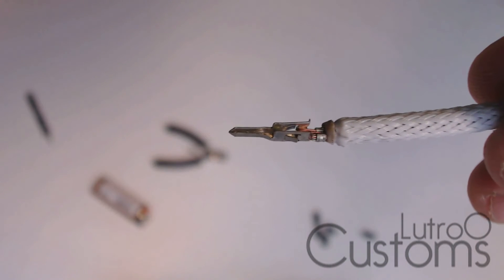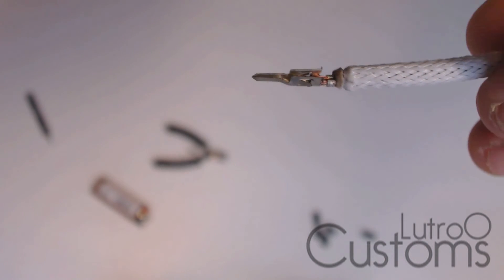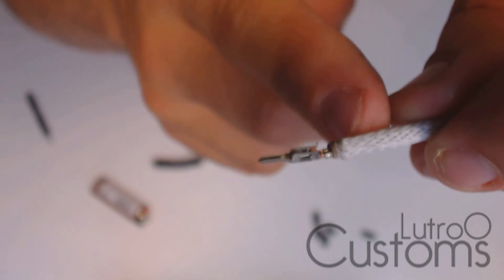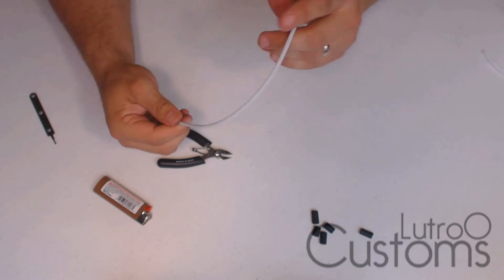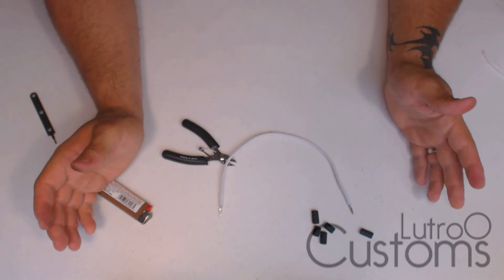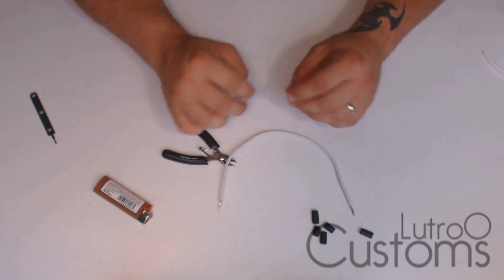You'll see a pretty good tack on there. If there's any burning up in the prong area you'll want to redo it, but a little burning on the tack itself is absolutely fine. This wire will now hold up on its own — the tighter you get it, the more it'll stay up. It trains the wire so it stays formed, and it provides coverage on the wire. That's why we stretched it, why we tacked it where we did, and why we measured it the way we did.